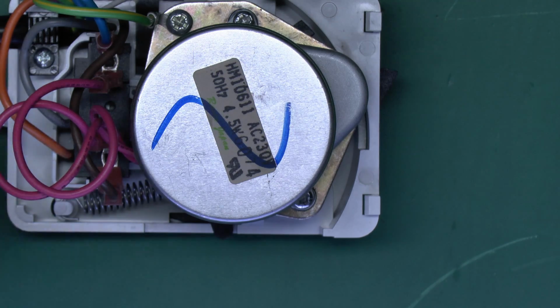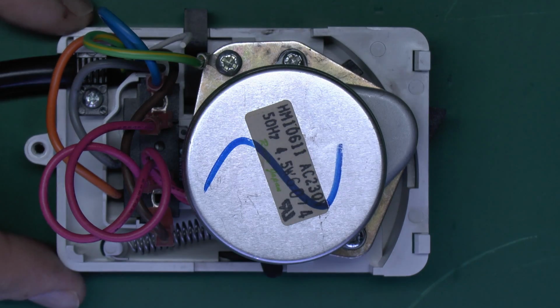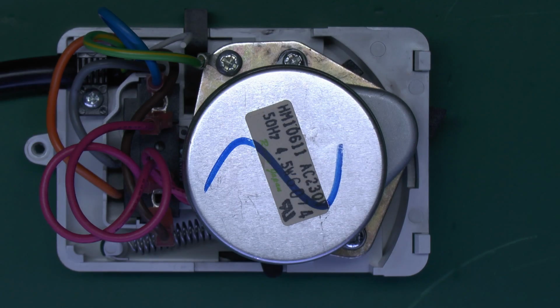So that's reached the fully open position there, and so the motor is no longer rotating, but of course it's still connected to the power, and therefore it's still producing a bit of heat inside. And notice the lever's now gone right across and actually partly retracted due to that odd mechanism we saw in there before. And then if we disconnect the power, the spring should pull it back the other way. So again, we'll see that just moving to the other position there.